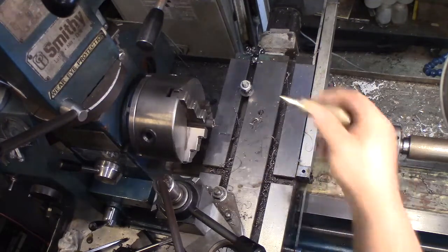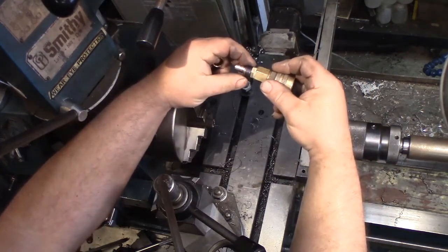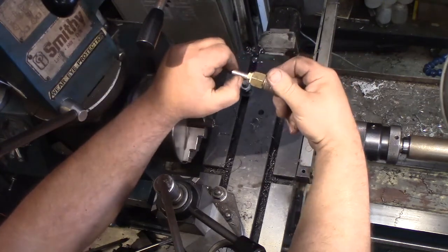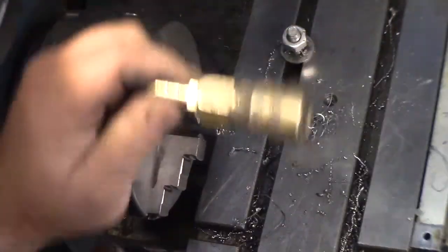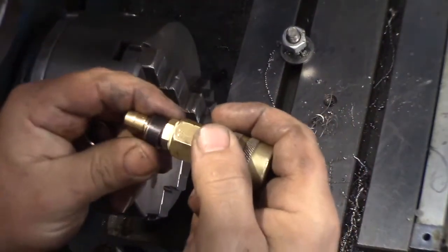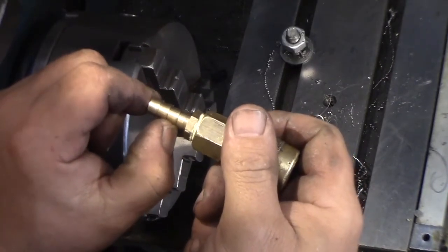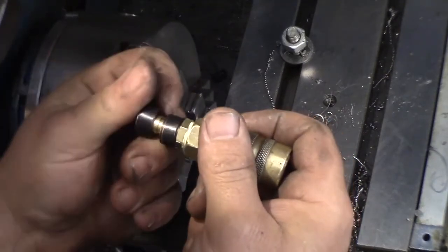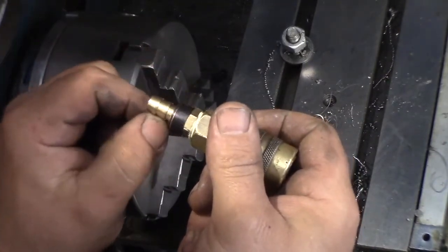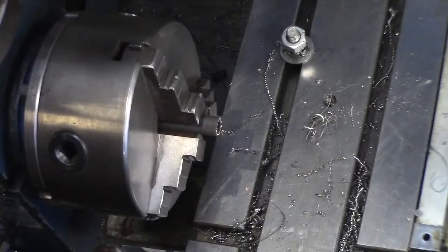Let's take a peek. So when the first ring is all the way up front, that's going to get us one good sealing point right in here. Oh, you can't see because you're so far away. When this one gets squashed, this rib right here is going to get a good seal, and that will be the one that keeps the hose from getting yanked out, and the other one's going to be a backup seal, and that will probably get two. So all three of those barbs should get a good seal on them. Yeah, I'm overthinking it. Calm down, Ed.